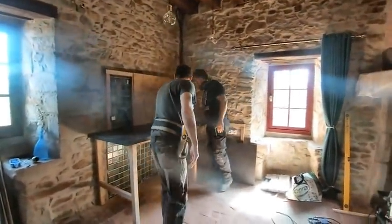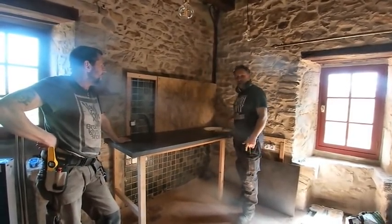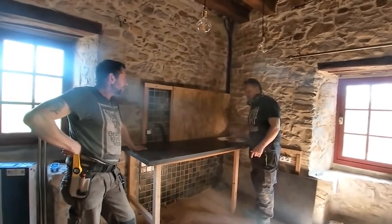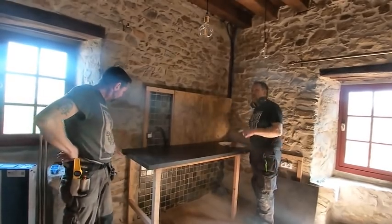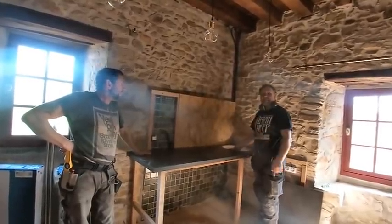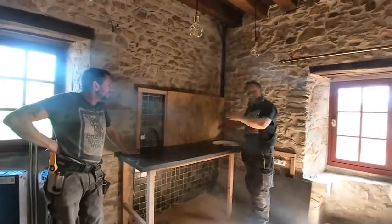Okay, then. Look at this hole here. This causes so much grief if you normally cut them out with a jigsaw. If you want a 50 pence piece shaped hole, a jigsaw is perfect. But this here, I bought many, many months ago. I bought a circle cutting jig, and because he's here, we sussed out how it worked, because I didn't really know. It cuts an absolutely perfect circle, which is perfect for the sink, and it even goes in with the waste.